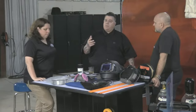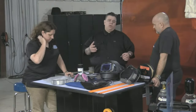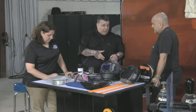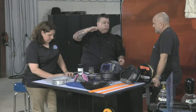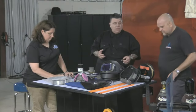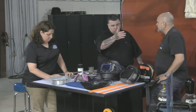Just like with resistance welders. If I'm welding a rear body panel, welding down low where it meets up with the inner floor pan, I might need a big, huge C-clamp. Once I get around the taillight pocket, I want to switch to a smaller one. It's lighter and easier to move around. And listen, in some cases you have to contort your body to match up to this.